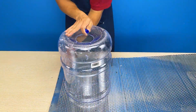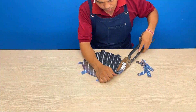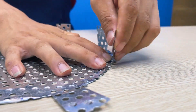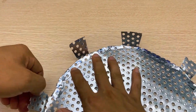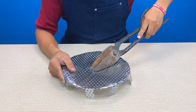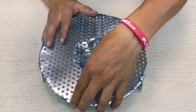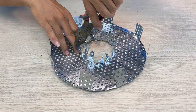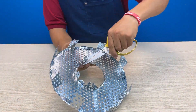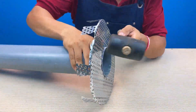Next, he places the container on a perforated metal sheet and cuts the sheet to the size of the container, then cuts it into a circular shape. He bends the square pieces around the circular shape upwards. Using a self-made compass, he draws a circle in the middle of the metal piece, then uses a cutting machine and pliers to cut the middle part into triangular shapes. Turning the perforated metal piece over, he bends the upright triangles with pliers and cuts off part of them with shears. He then places the large PVC pipe segment on top of the perforated metal piece and uses a hammer to firmly secure them together.